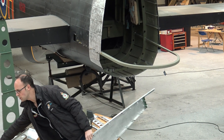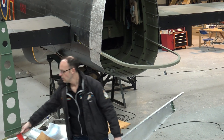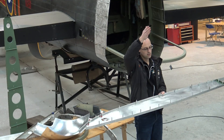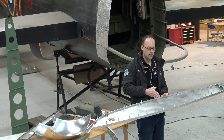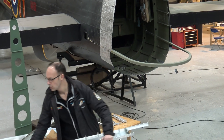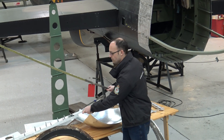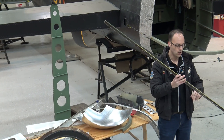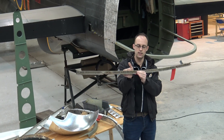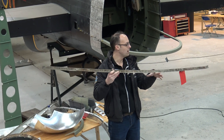The original extrusions had to be replaced. This is the original piece and you can see the big holes where it bolts onto the wing with wing studs. From this web and extrusion going upwards are the posts and spars, and between those are the ribs that sit between them. In between the spars going up are smaller sections called stringers. We've had quite a lot to replace including the extrusions. We used a British company to make the extrusions for us and decided to have a full aircraft set made — two extrusions in each wingtip and two corresponding extrusions in the wing. So eight extrusions in total, costing us £10,000 to have made new.